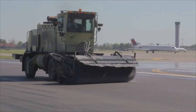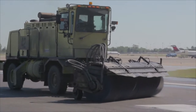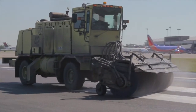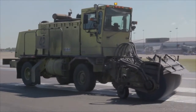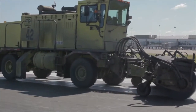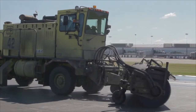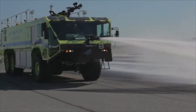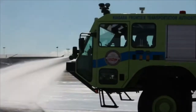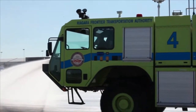Before starting the process, you need to prepare the runway. Run sweepers back and forth across the runway at high RPM in the opposite direction of where the airplanes land, to remove any debris and score the surface of the runway before applying the cleaner. On sunny, hot days, the water truck should make a complete pass over the runway to pre-wet and cool down the surface.